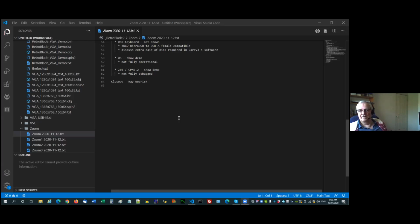Maybe if it gets nothing back, continue to try it. Because that way you'll get the quick response. You won't have to wait the length of time initially to see that you've got it, but you may have to. Yeah, Jim Granville just put on the chat that Load P2 repeats and interrogates every 50 milliseconds. Because that's what would have to be done. If the SD is not there, the chip's going to wait 100 milliseconds, and then it's going to go ahead and boot if there's no serial.